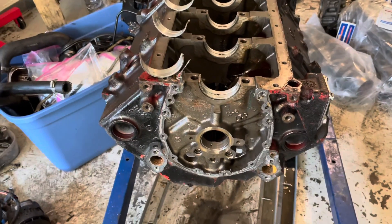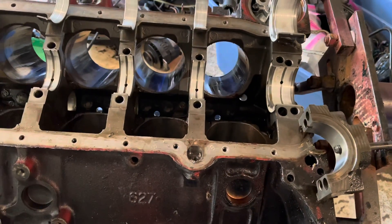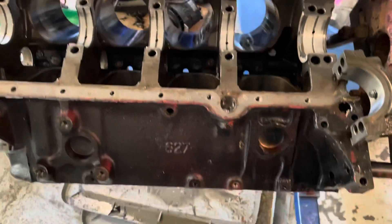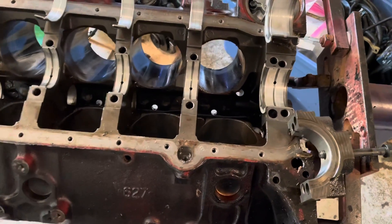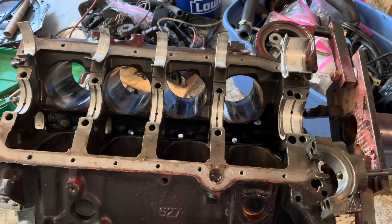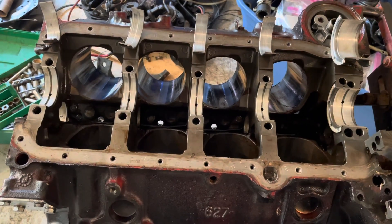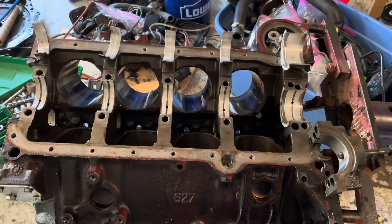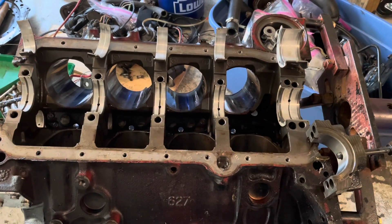Alright, so this block is done. I'm about to take it out and put it in a truck. I'm going to check the bore conditions — see if these bores need to be re-bored or just honed. I'll check them with a dial bore gauge, see how much clearance I've got, and see if it's possible to just hone without boring. But since I'm going to have to buy new pistons anyway, I might as well just go ahead and bore it — it's only an extra $150 to get it bored. That's it. Hope you enjoyed watching Part 3 of the teardown. If you have any questions, put them in the comments. Thanks for watching.